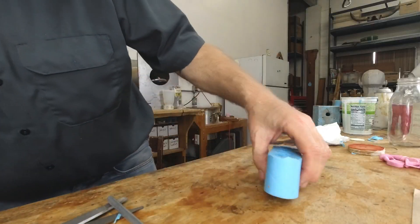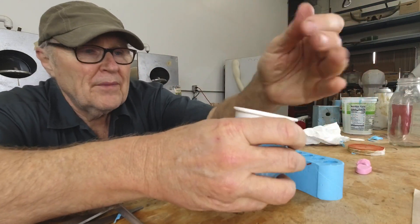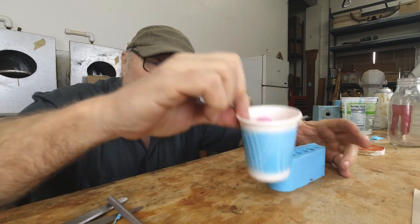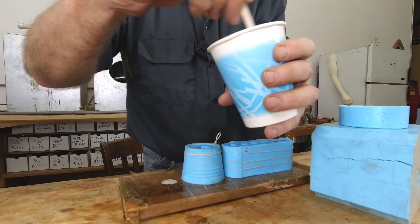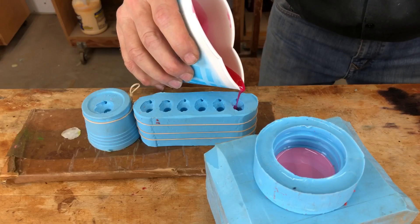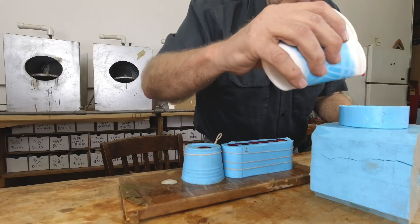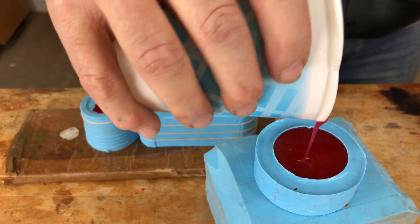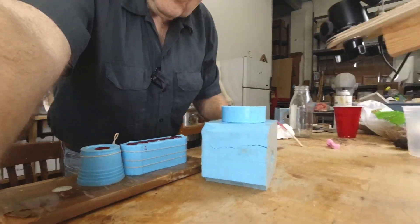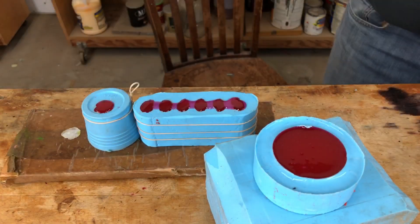These castings — I know because I poured a bunch of them — I like them at six grams each. But just to verify, I'll put them in a cup and weigh all six at once — should come to about 36 grams, so probably about a 40-gram batch to pour six of these. Get this well mixed — no time like the present. Got seven of those poured; the rest we can just dump in. The power of math — just the right amount. On this one, I just put the mold on a flat, bigger mold to make a bottom.